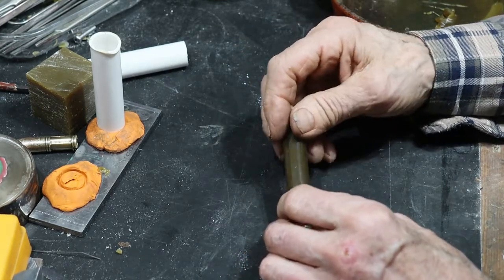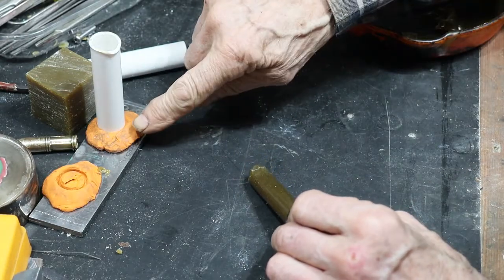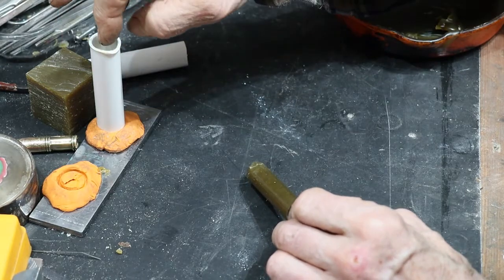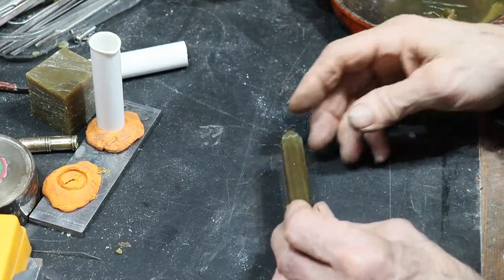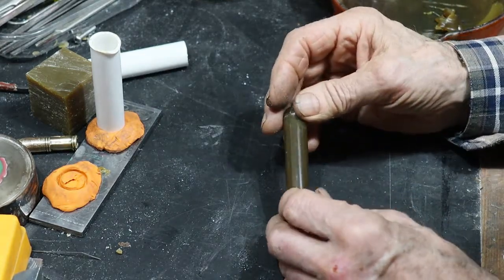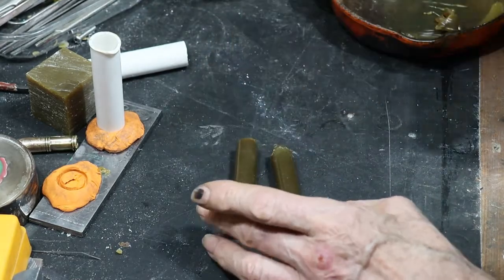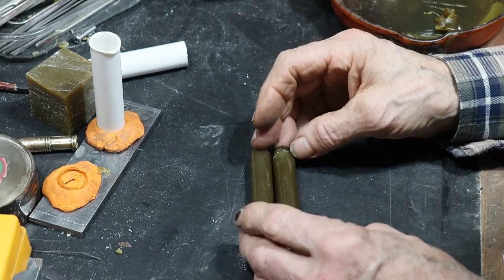Now you want to be very careful when you're doing that that you don't have any water around. You don't let the water that's around the outside of the tube get inside it. You don't get any drops of water in there, because if you do, you'll get thousands of little bubbles, and then the surface of whatever you're machining will be of no use. So we've got a couple of bars of machinable wax, and we're going to take those out to the lathe,